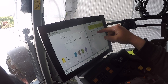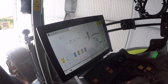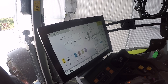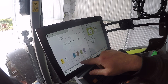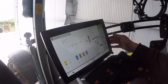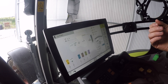You've got your spools section where you can click on spools, do your flow settings and set your timers. This screen, which I think is from 2018 onwards, is so good and easy to navigate without even reading up on it - you can just work through it yourself, it's so simple. You've got transmission settings, engine memos, droop settings - you can set how quickly it accelerates and how quickly it switches from forwards to backwards, which you'd want quick if you had a front loader on.